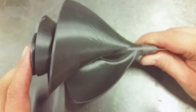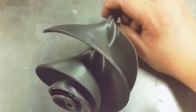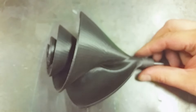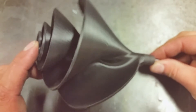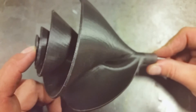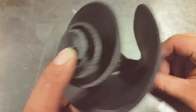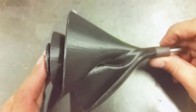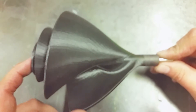Jay developed his shape from a frozen whirlpool — did a lot of research, reverse engineering, really perfected it. For mine, I found a couple of Archimedean spiral equations, plugged them into SolidWorks, got a basic spiral, made some educated guesses, and got this shape. Overall I'm really happy with how it turned out. CAD systems like SolidWorks don't really lend themselves to organic shapes like this — nothing's flat or truly 2D about it. It's a complex, tricky shape to draw, so it was a fun challenge.